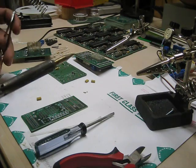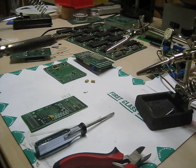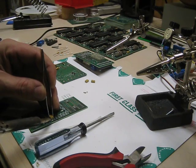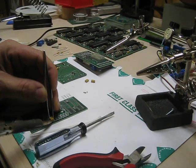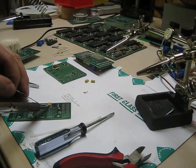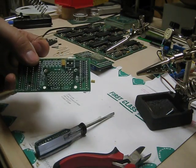Let's do a bigger component here. It goes in towards the capacitor — yep, same one, oriented properly. Basically, you heat it up, set your component on there where you want it, let your solder cool, and there you go. All you need to do is put solder on the other side and you're good to go. That part right there is in place and it's nice and flat, and my other little capacitor now has solder on both sides.